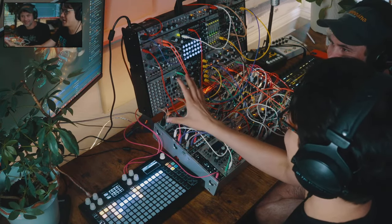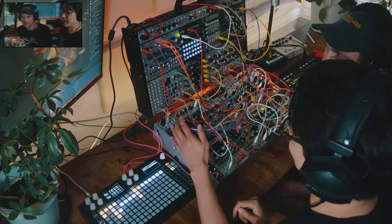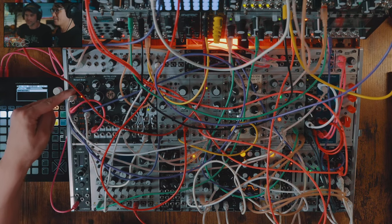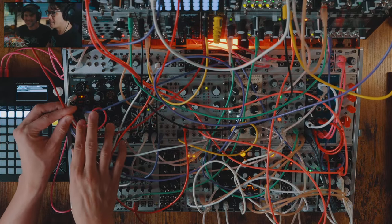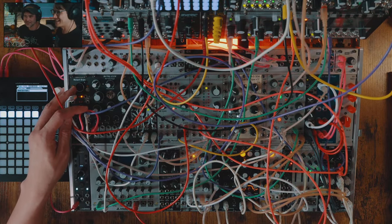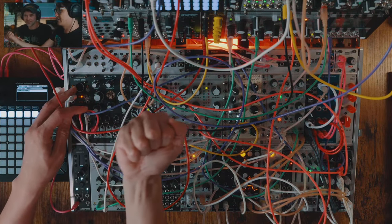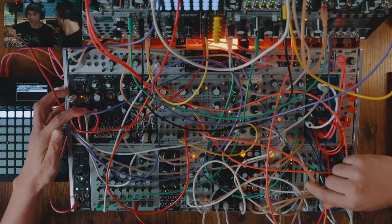One of the things I do a lot with the Assimilator, and here's a trick, is this MIDI module, the Mutant Brain. It has a MIDI port here, but the module doesn't have a MIDI jack, so I soldered some wires from this port over to the back of my Intellijel case. Instead of having the MIDI cord right in the middle of my case, where it's a big cord, it's out of the way.